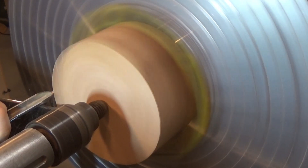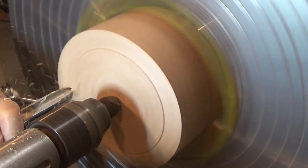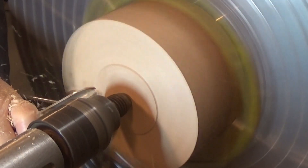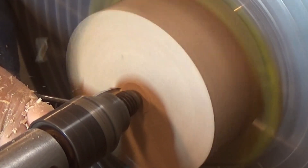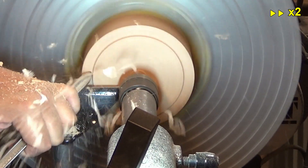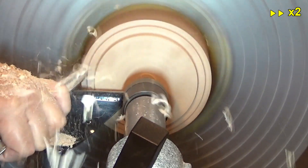Because of the size and weight of these jaws it is better to turn below 800 RPMs. With a three-eighths of an inch ball gouge I will true up the surface. I will also remove the step that the blank had, but leaving enough material in the central part to form a tenon to later hold the piece.